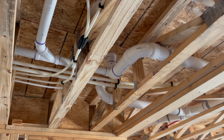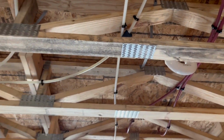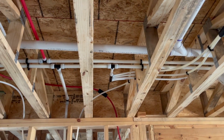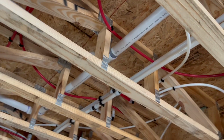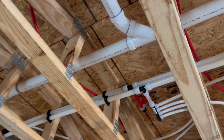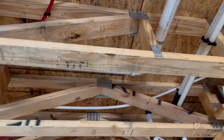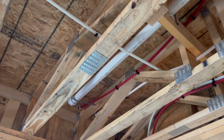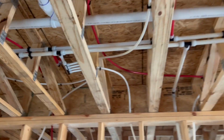So out of that side outlet, come into a 2-inch combination that comes over, gets a shower, can't really see it very good, comes over and it gets a tile shower in the master. And again, in this bathroom, we have 2 vanities and it's wet vented through those vanities. You have one right there, comes up, goes over to the one lavatory, and then out of that combination, it goes over, sweeps over, and goes to that vanity as well. Again, that's 4 fixture units on a 2-inch wet vent, which is perfectly legal here.